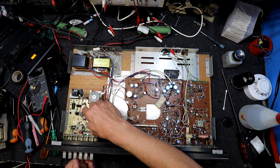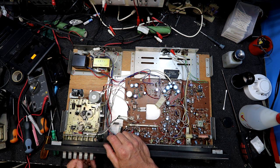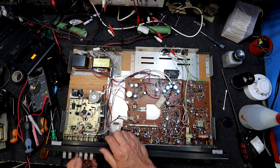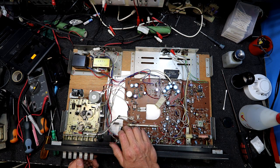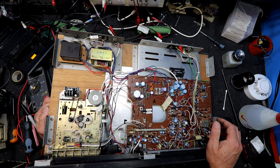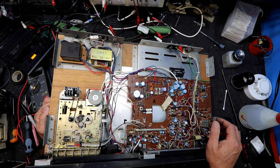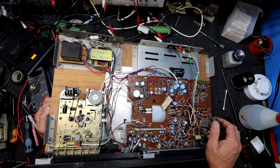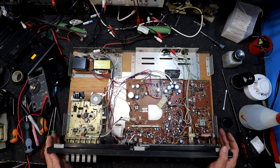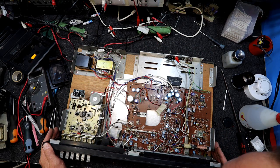You've got a basic idler. I actually need a pinch roller out of one of these for an old National, but I don't think this is the same. Mabuchi motor. Oh, this is it, actually, a standard motor, 12 volt DC, 2400 RPM clockwise. It is an EG510AD, so it is a pretty standard motor number. They'd actually standardised them at this stage. That's impressive.